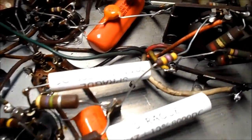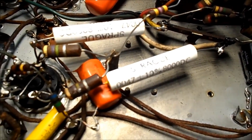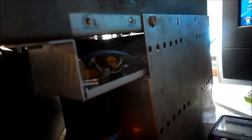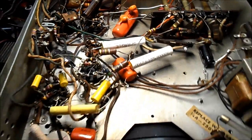Not all the time, but it'll get these little streaks across. I'm wondering if it's because I'm using the disc capacitors in the horizontal deflection section versus the regular Mylar or whatever they are. There are two here and two inside the horizontal section over here. I'm beginning to wonder if it's a .001 at six kilovolt disc that's causing the horizontal streaking now and again.